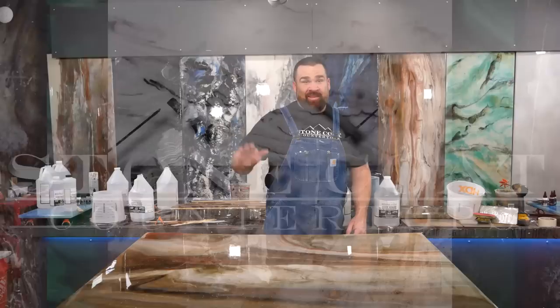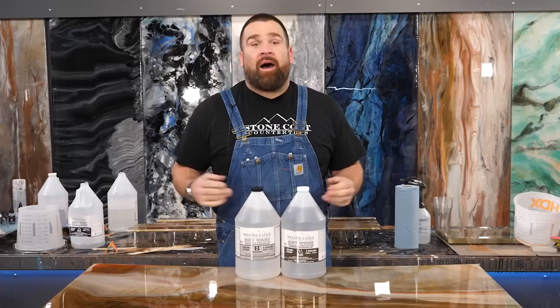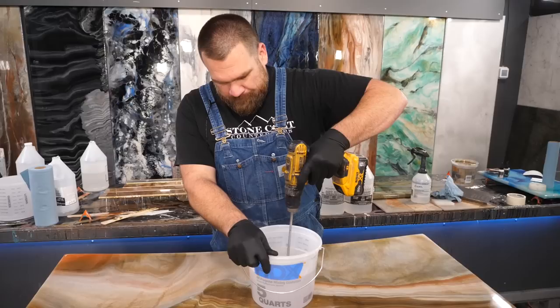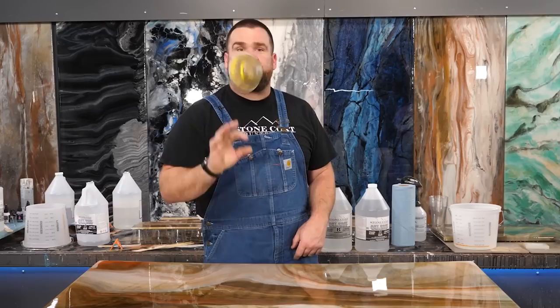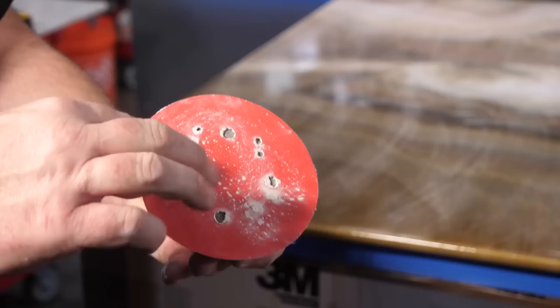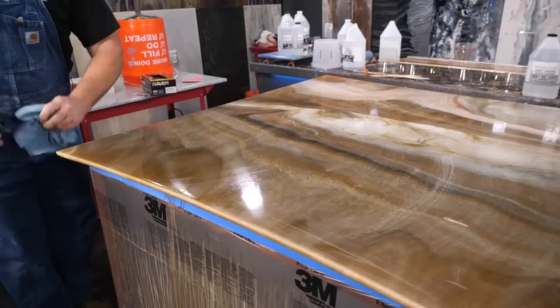It's the next day. I'm going to sand this beautiful tabletop with 220 grit sandpaper and clean the dust with 91% isopropyl alcohol. I'm using Art Coat as my clear coat to add durability and extreme UV resistance — Art Coat's UV resistance is second to none. Art Coat is a one-to-one epoxy by volume, not weight, and you mix for two minutes with a paddle mixer — be sure to hold the bucket and keep the paddle mixer from scraping the bottom and sides. I like to remove my sanding pads off the backer to hit the edges so I don't over-sand.